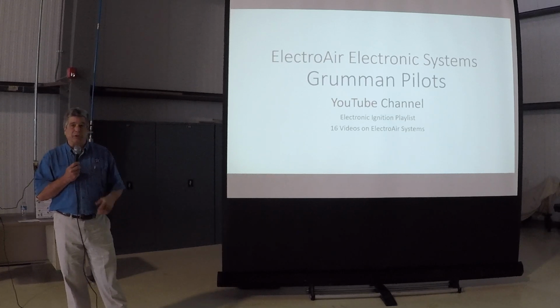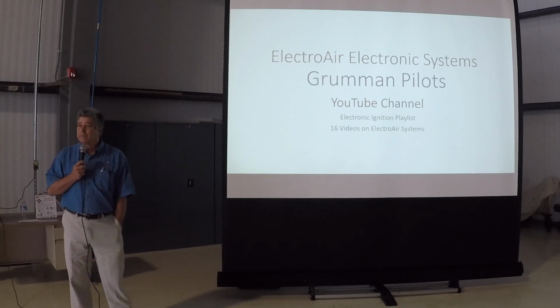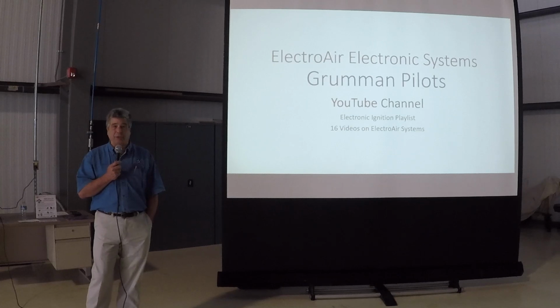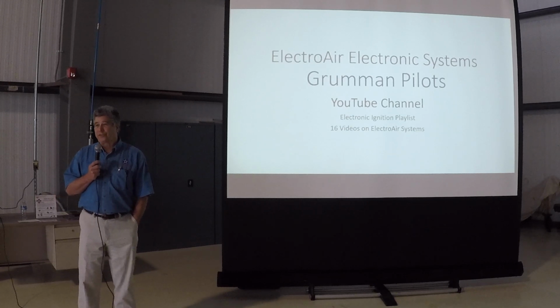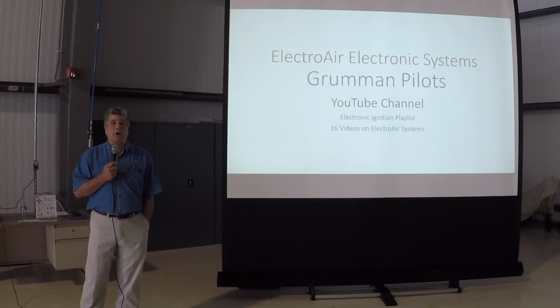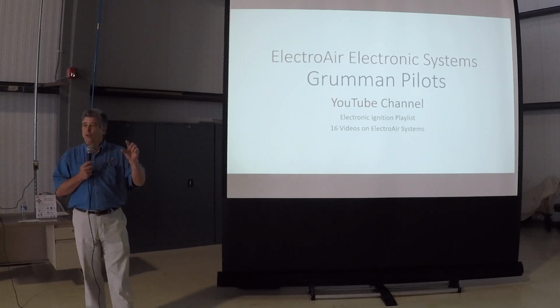Now, the difference between the two, a magneto produces at optimum a 12,000 volt spark. Usually during starting, it can be anywhere between 6,000 to 8,000, depending upon the age of your mag. The electronic system starts off at 70,000 volts. It's a much hotter spark as opposed to that. It's also a much longer duration. It's 4 or 5 times the duration of a normal spark.